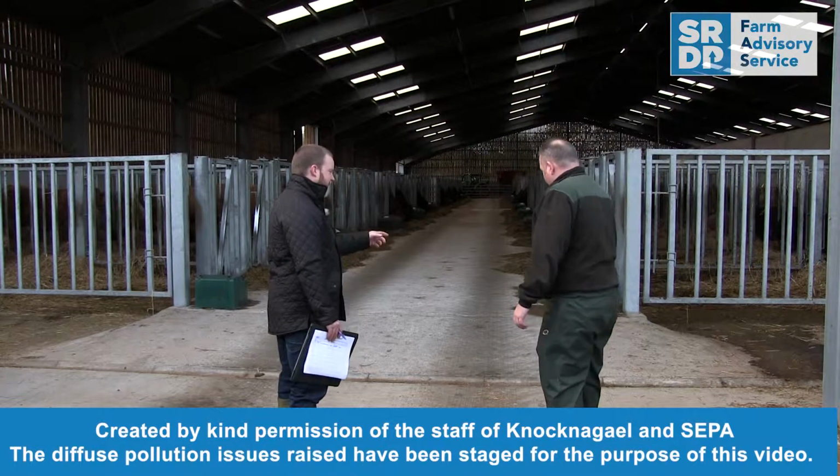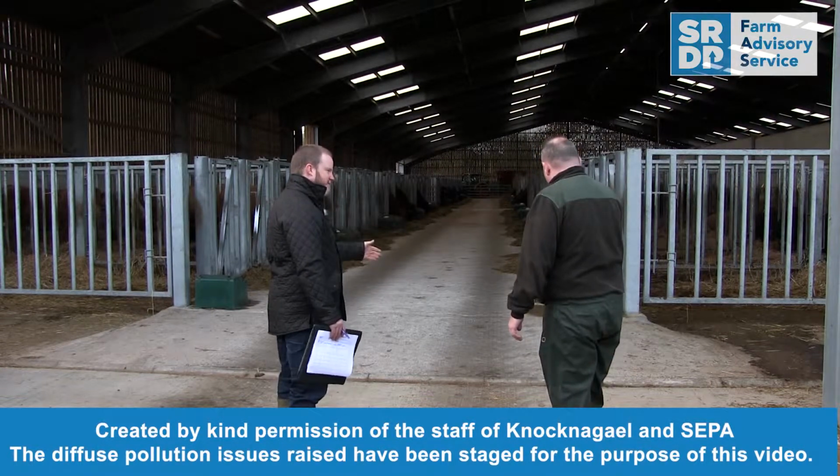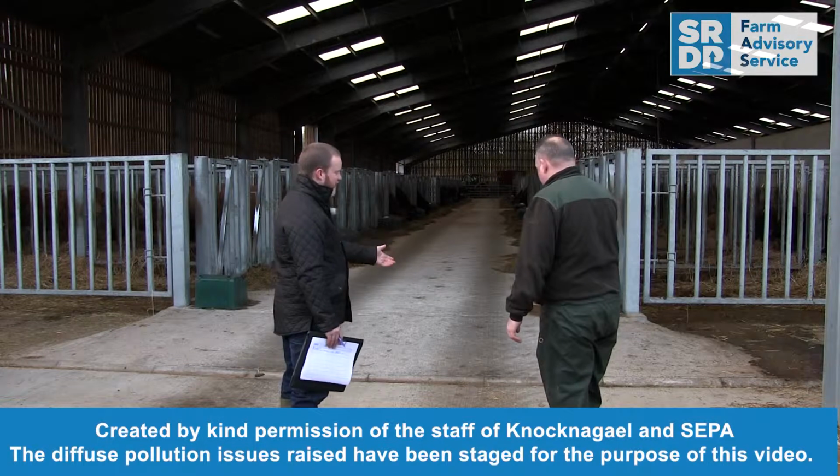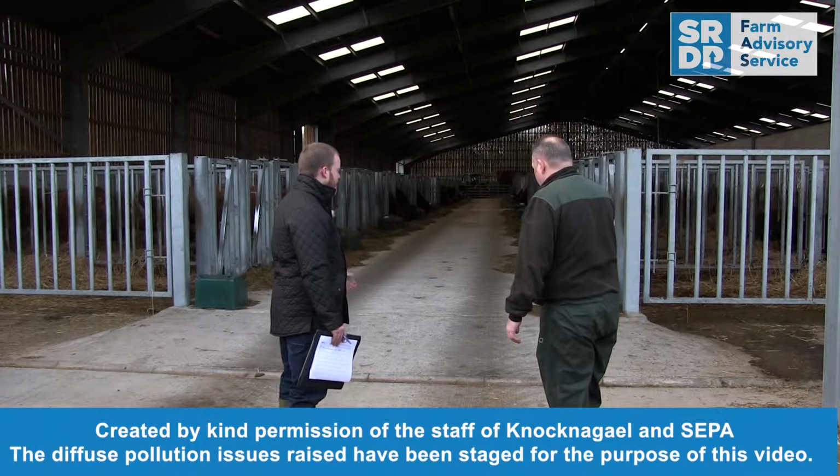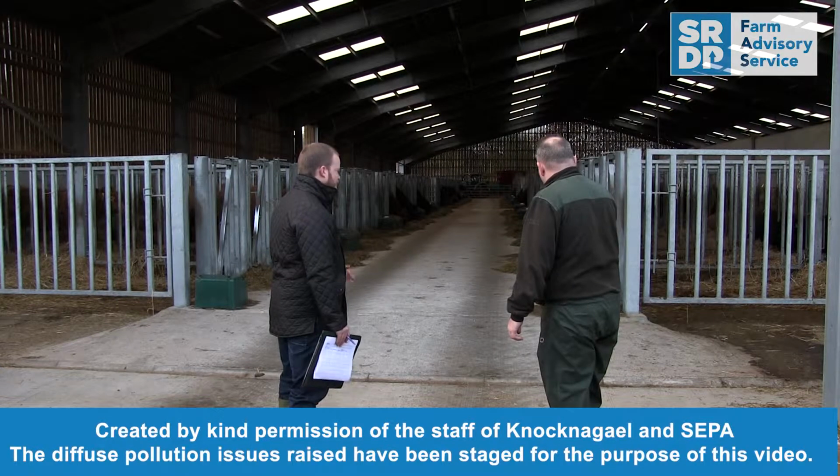And this is the kind of thing you can keep an eye on quite easily as well, isn't it? Because it's nice and visible. What we don't want to be seeing is these channels choked up with debris, muck, or whatever it may be, because if you can't see it, you don't know if there's a problem in there. So it's good to see that it's nice and clear. You can see the feed passage is nice and clear as well, so you obviously have a good level of maintenance and management in the building here, which is great.